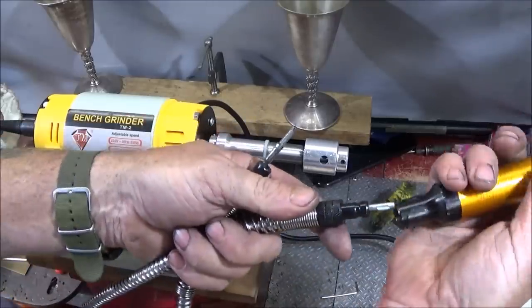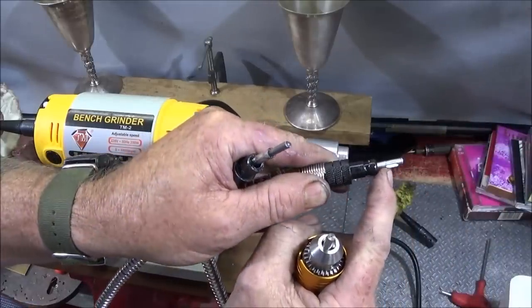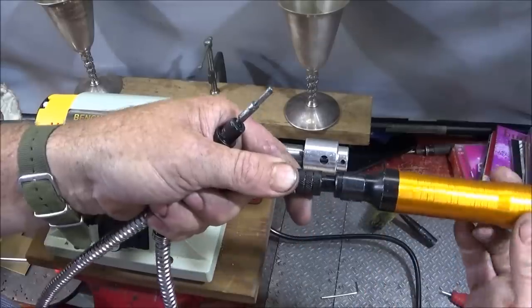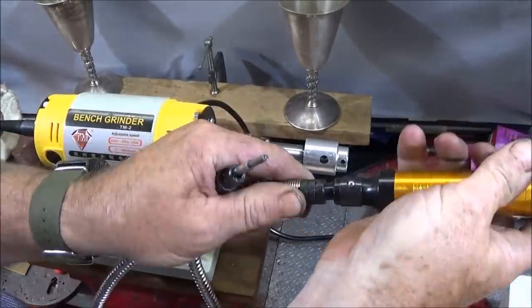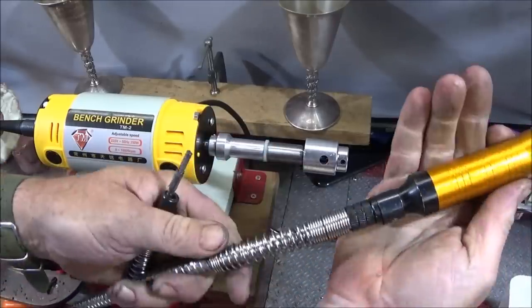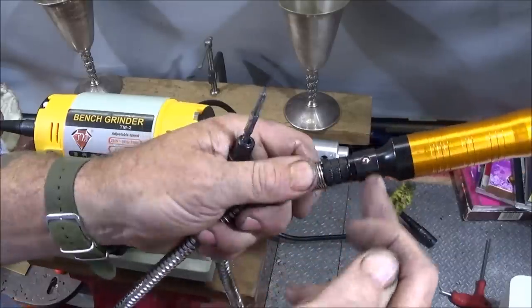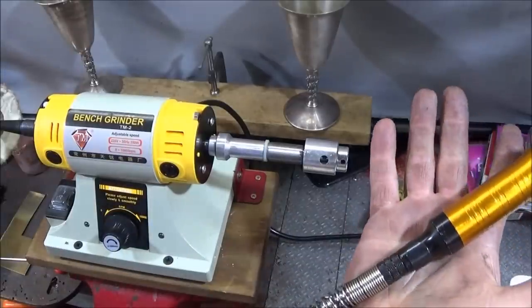When you put these back on to the shaft, you have to find the position for that tab to go in. So first you feel for that. When you actually feel that click into position, you just push it home and it clicks into place on the ball groove. That ball sits in that ball groove and locks it on the end of the flexi shaft.